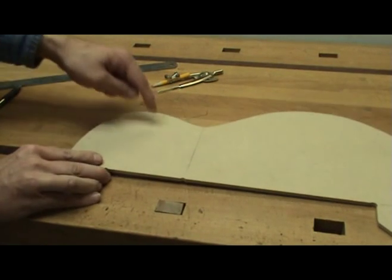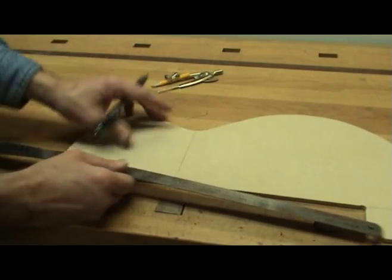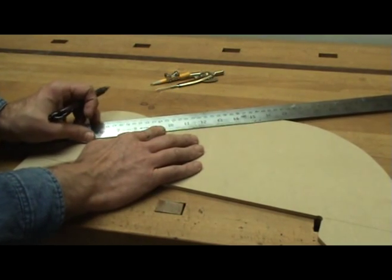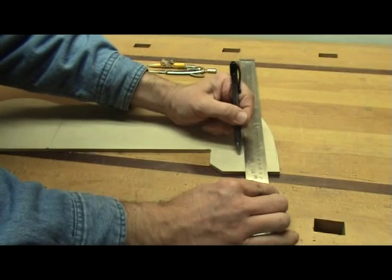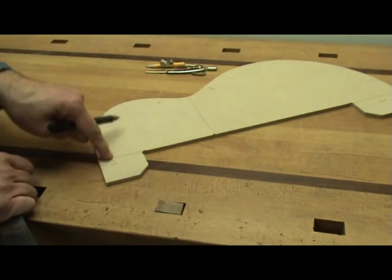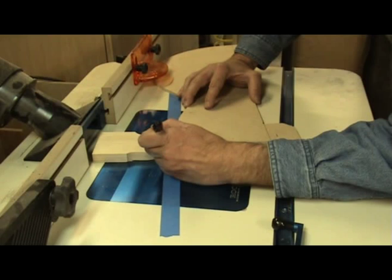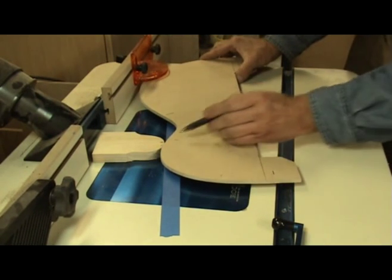I'm going to use the router for cutting those slots where the rollers go for the LMI side bending machine. I'll start by marking where these slots need to start and stop — that's two inches on each side of the center line. Out on the edges I want to go a half inch below the center line. So I want to start here, come around, cut, start here, come around, cut, and stop at my lines. Before making the cut, I'll mark on my fence approximately where that bit starts and stops, so I know exactly where it's going to start cutting.